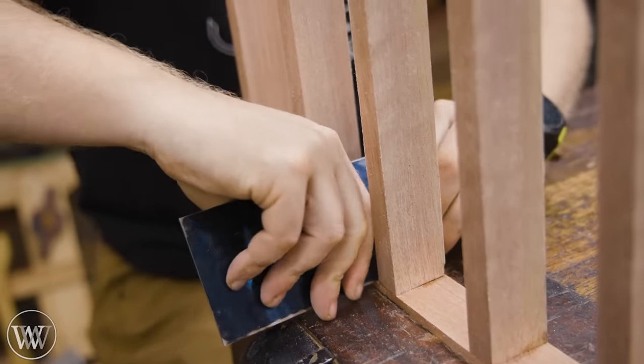Some projects I do like to glue up after finishing — each one is a little different. Look, the coins work! I want to put all the coins in here and make sure everything works before putting finish on. As for the finish — boiled linseed oil and paste wax. I don't like any film finish on most things; I want to feel and see the wood. No poly, no shellac. That's one of the reasons I love Rubio Monocoat — it has that raw wood feel. Boiled linseed oil and paste wax really do that well. They're not a great protective finish, but it's a very easy finish and I love the look. We're going to put a hanger on the back, though I haven't figured out exactly where I want to hang it yet. At the moment it's sitting on my desk.